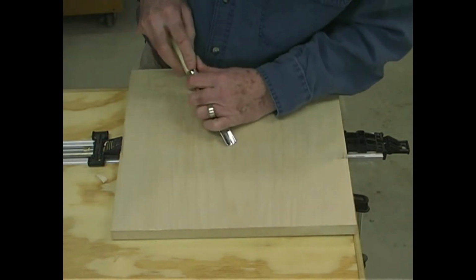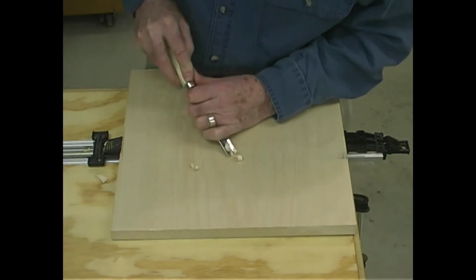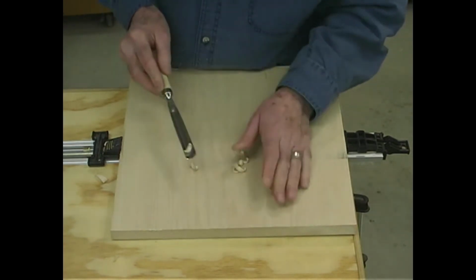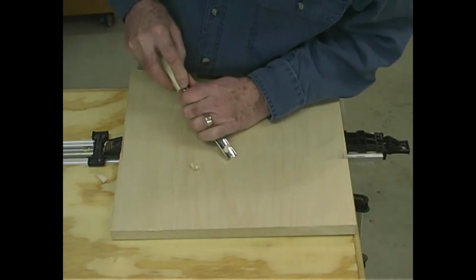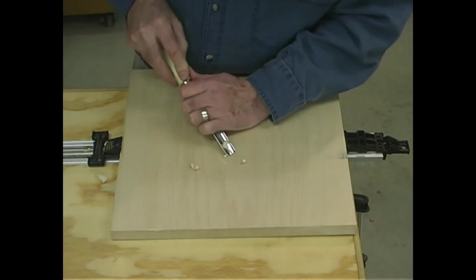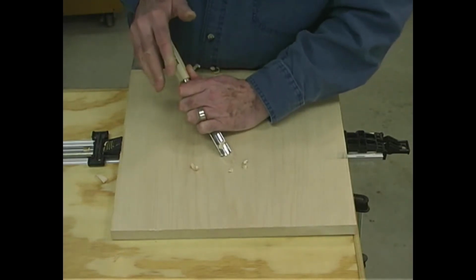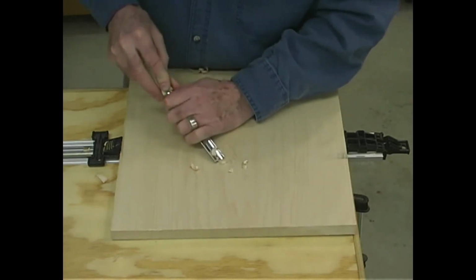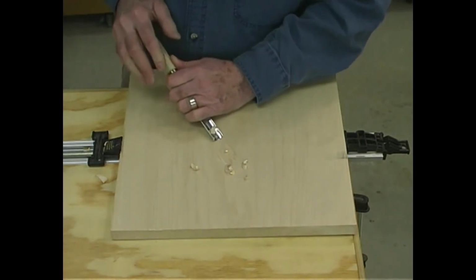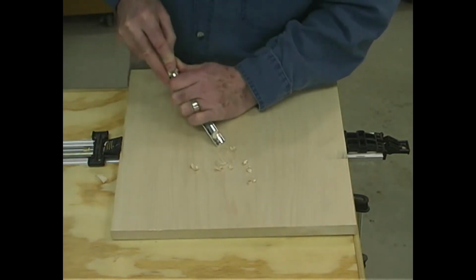The important thing now is that as you carve, you pivot your arm or your hand to produce the cut. Now, it's important to remember that as you are doing this, if the tool is moving, your arm or hand that is doing the support is stationary, and you just pivot. If you have to move to a different location, stop the cutting, move, and continue the cutting. You never have both the cutting and the arm moving at the same time. If you do that, you're liable to lose control and you slip. This way, you have complete control.